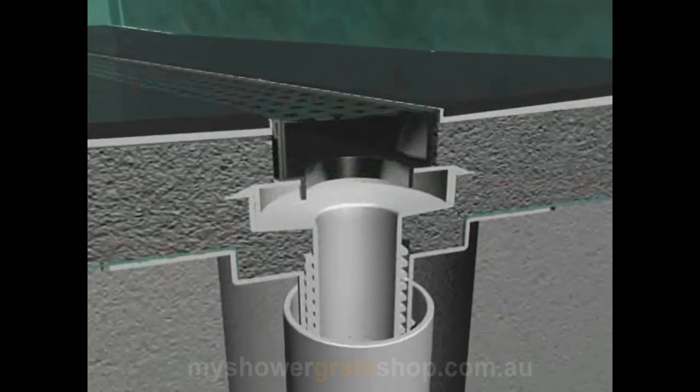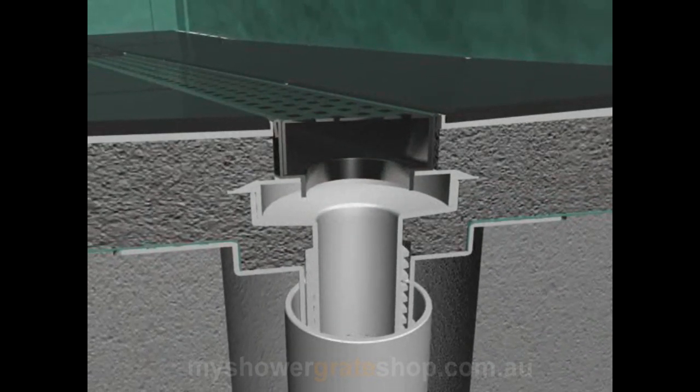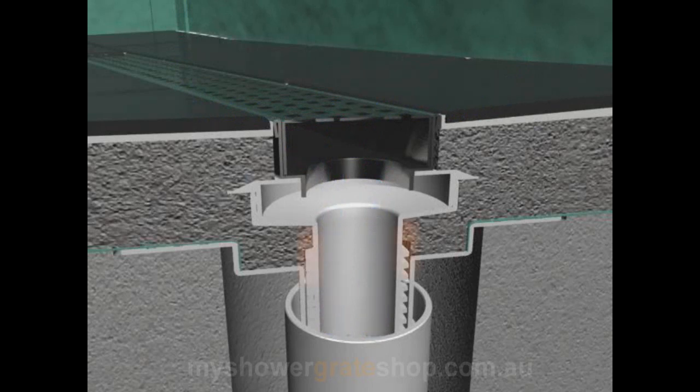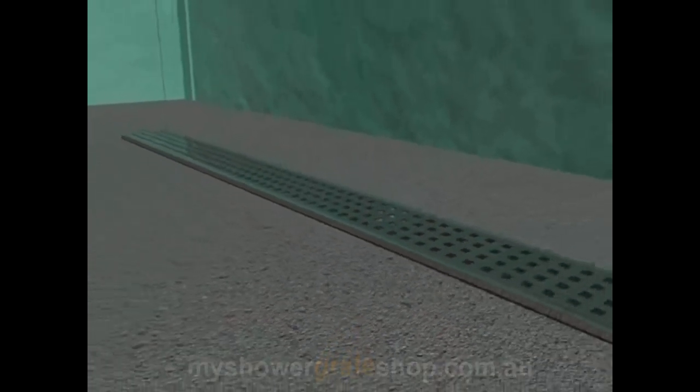In this particular illustration, it shows after the tiles are laid how water will typically flow both on top of your tiles and down the drain. Should you have an instance where you develop a leak somewhere in your bathroom, in the highlighted orange areas, we'll show how water in the subsurface sand cement can exit your bedding safely down the plumbing via the puddle flange.